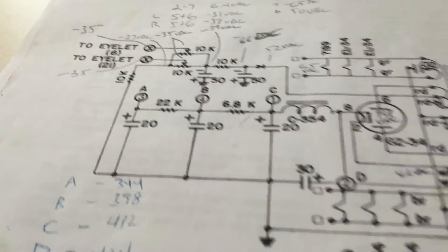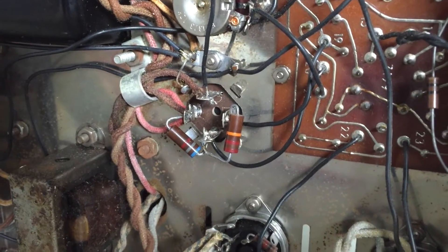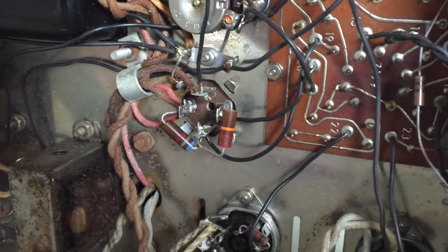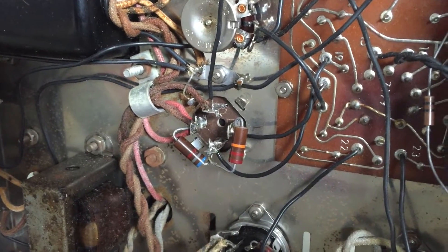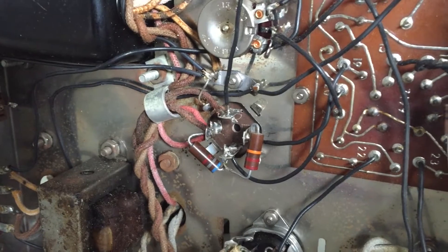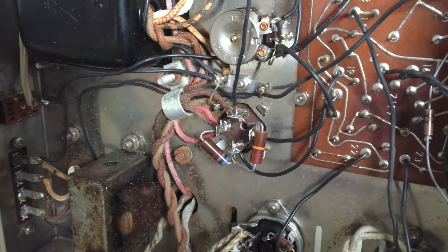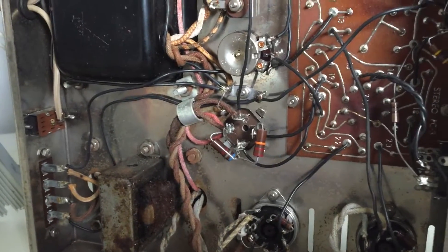If you want to stay with the original values in the circuit, that's exactly what I did. However, if you choose to increase the capacitance to further stabilize the circuit, that wouldn't be bad either. I don't know at what point the returns would not justify the size of the capacitors, so long as they're rated for the proper voltage. If you're still using the original quad cap, people will tell you they're still good if they still function. But if you don't have equipment to measure the leakage and ESR value of these capacitors, you should know — if you start with shoddy components, you're never going to get your amplifier to work right.